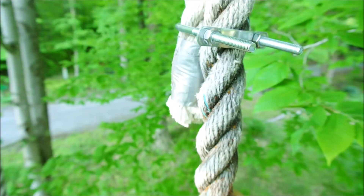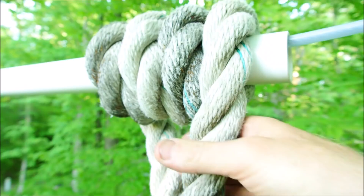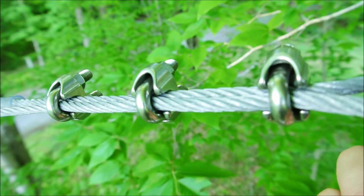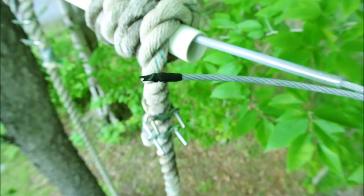And the rope — notice that the dead end is to the inside of the swing and the live end is to the outside. That's for stability. I gave a fourth wrap just as a height adjustment. Speaking of saddles being on the dead end, that's the expression: 'don't saddle a dead horse,' and that applies to these U-clamps. You want to keep the saddle to the live end, not to this side. This is the part that the U touches. Alright, time for me to go down. Hope this was useful for you.